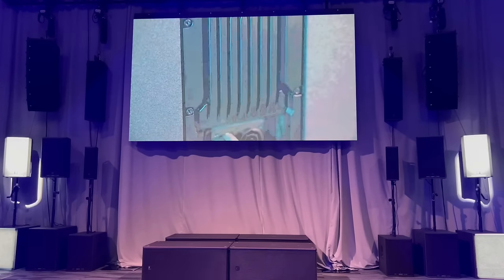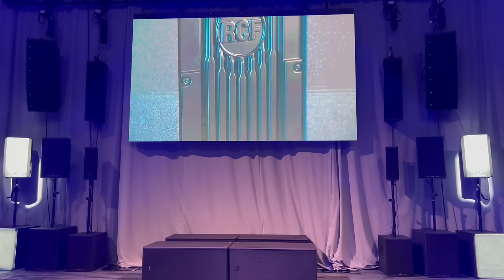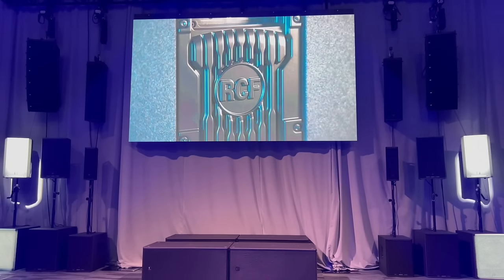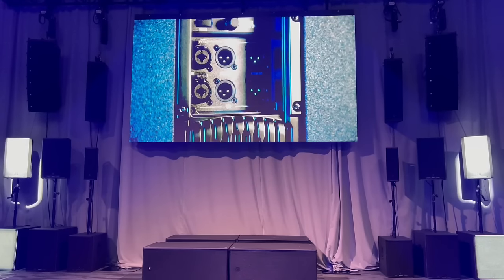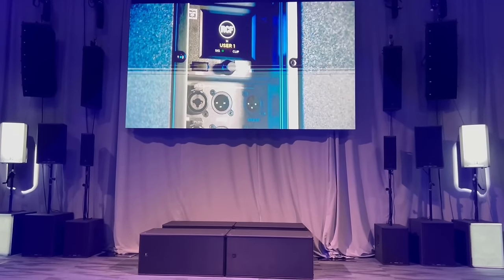These new features are without compromise to the subwoofer's performance. Its 18-inch low-frequency driver is driven by a Class D 2200-watt peak amplifier, resulting in 135 max SPL, perfect for mid-size venues and portable applications. Let's listen to the Sub-18AX, accompanied by the ART915A.